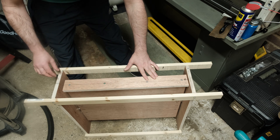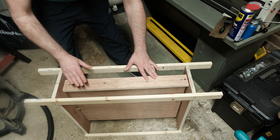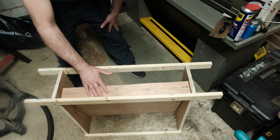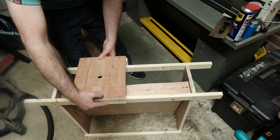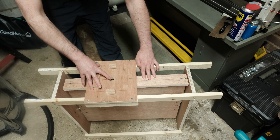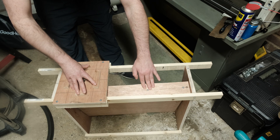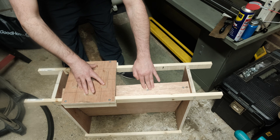When building this, the main thing you need to consider is to make sure it is perfectly centred, so when it's in the middle it's nice and horizontal at the top where you put the fretboard on. Then all you do is put your router onto some sort of slide, make sure the router's centred, and then just rock this back and forth as the router's running — move it a little bit, rock it, move it, rock it. And that is as simple as that.